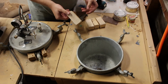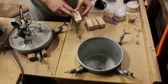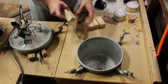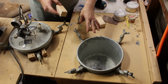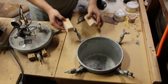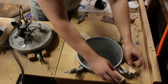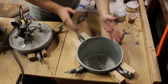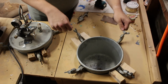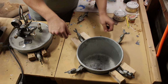Essentially, they need to be wide enough and long enough to hold 2 screws without cracking, and we're gonna hopefully not make that happen. So because of the location of this guy, well, first let me say you only need 4, right? Because you need 2 on each side of each opposite bolt assembly, because that's going to keep it from moving when you want to tighten it, which would push it this way, and when you want to loosen it, which would push it the other way.